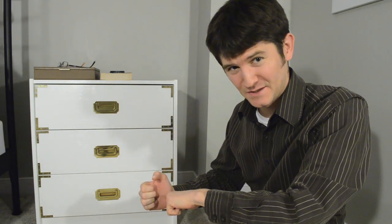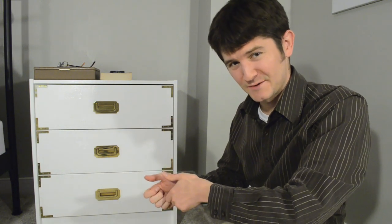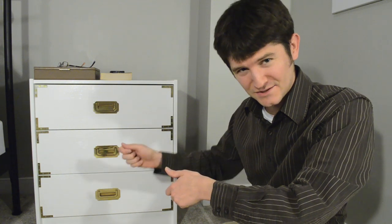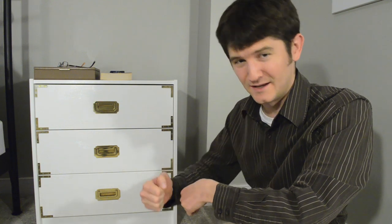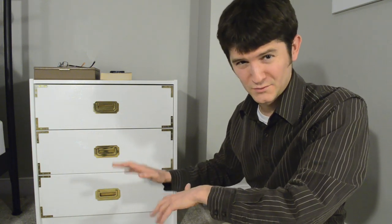At first I tried to go straight in with the high-speed cutter and all it did was blow smoke everywhere. What you want to do is take the high-speed cutter, go along the edges of the design, and then slowly start to peel away at the layers of pine until you get the depth you want. Then edge up the sides so your recess drawer pull fits nicely into the recess.